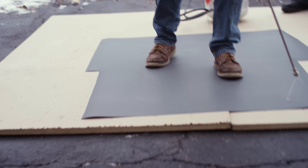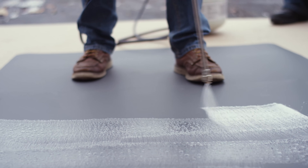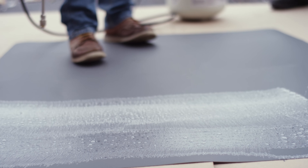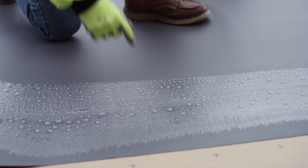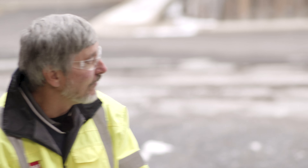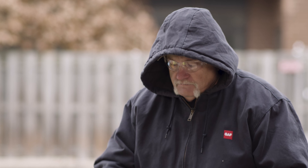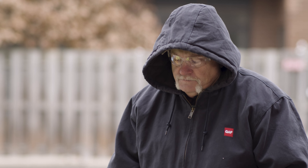So we're going to go too heavy. You really don't want to see this for the installation. And another thing you don't want to do is overlap — you're overlapping by like 75%. We don't want any overlap. So why is this too heavy? It's bubbling, it's blistering, and you're not going to get the right amount of coverage either. What would happen if a guy did this in the field and mated everything together? It would blister — you would see blisters all over your roof, and those are not going to go away. That's not good for the contractor's bottom line. This is what you definitely don't want to see.